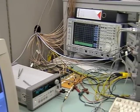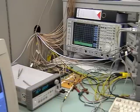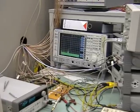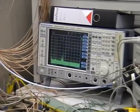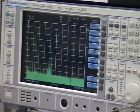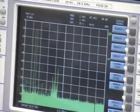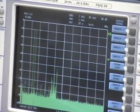To correct the mismatch of the DAC current sources, we can activate the self-calibration ability of the DAC. After some calibration activity, we see a significant improvement in the DAC output frequency spectrum. The mismatch errors of the DAC current sources are corrected, the harmonic distortion spurs are removed, and the useful dynamic range of the DAC is improved.